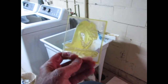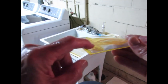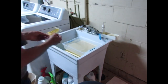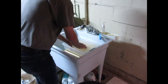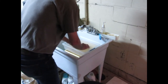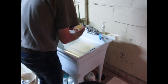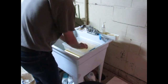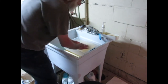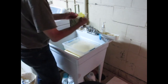The ultraviolet light makes the polymer insoluble, so the parts that are exposed don't wash away and remain in place. The parts that were not exposed wash away. The polymer coating is just thick enough to provide a printable relief surface. Developing will take about two minutes.